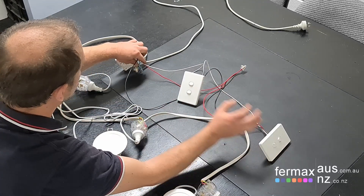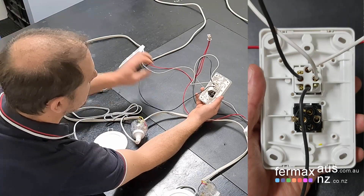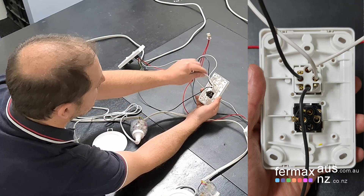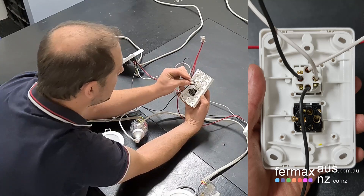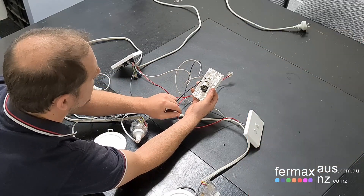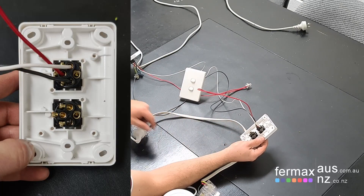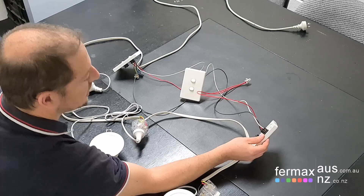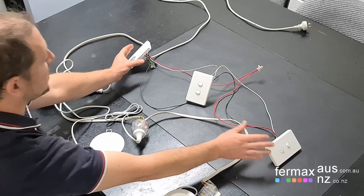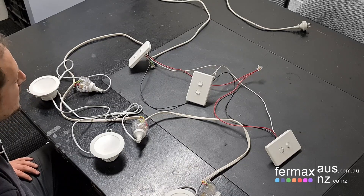The white and black, which is number one and number two, wires into this mech, which is an intermediary mech — you need an intermediate mech — into the terminals here, which are terminals number one and three. And we've got our blacks in two and four, and then that wires into numbers one and two into our final switch over here. As you can see, it's quite complex in terms of what's required to wire and configure a three-way switch in conventional methods.